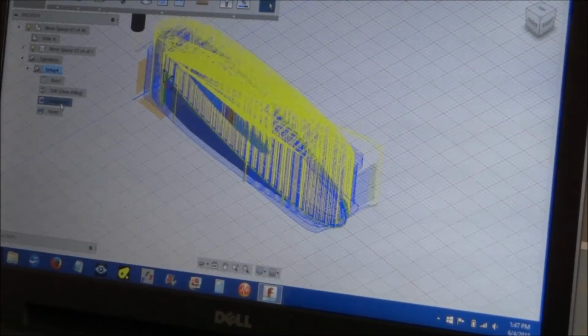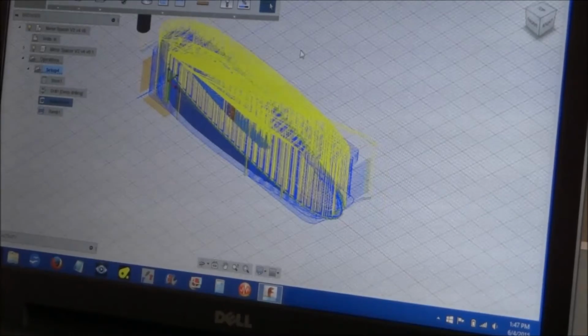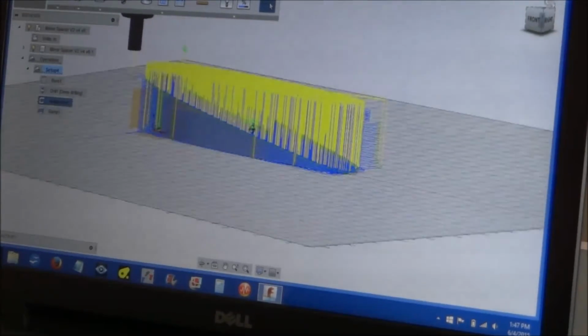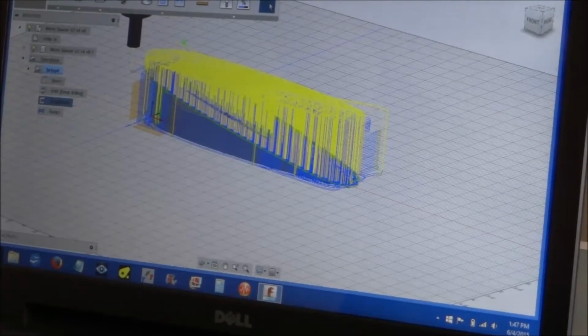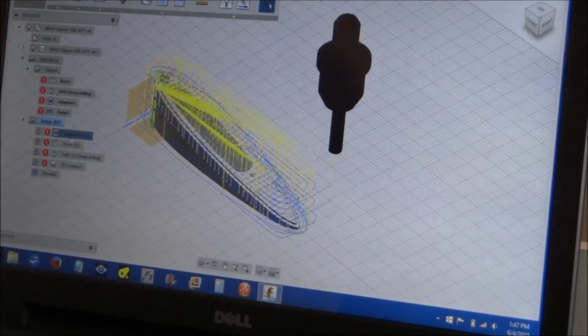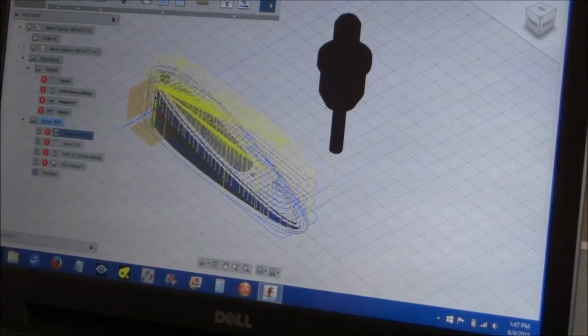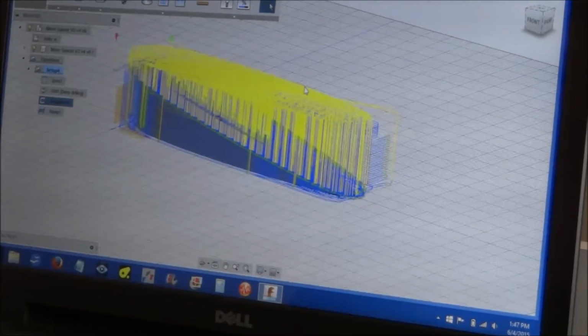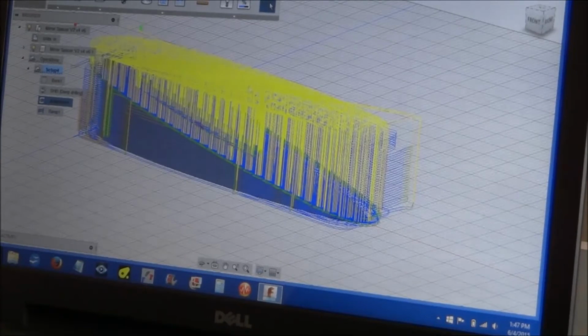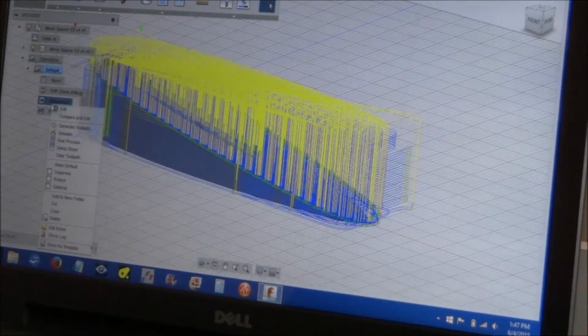Can't figure it out. Fusion 360 has adaptive clearing, which is something that I'm not used to, but it's supposed to maximize the tooth load and the chip load to take the maximum amount of chips out as possible. And because of my mini mill, I'm not able to take as deep of a cut with it, so it was generating a lot more lines of code. But this is the adaptive clearing for this particular operation,